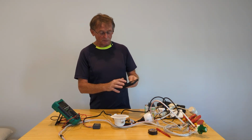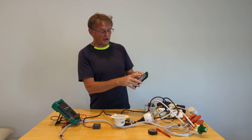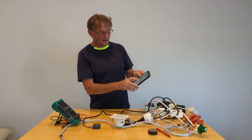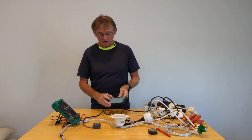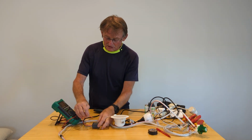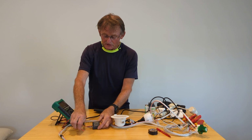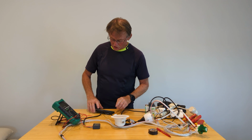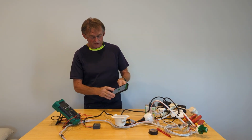So what we do, we open up the app, we go add, with hub, micro module, Wiser hub, add device, module without the install code. Now we're looking for the flashing lights. To get that, we must touch the active into the input terminal 3 times. 1, 2, 3. Now the red light will start flashing. Okay? So we go, yes, the red light is flashing, and start configuration.